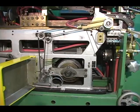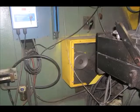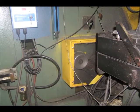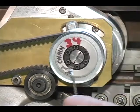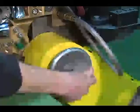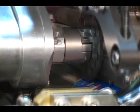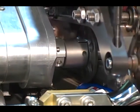With direct drive, machine timing failures due to backlash are virtually eliminated. Timing used to be set back in the feed area using a hammer to loosen up a taper-locked handwheel. With the squaring wheel's rotary gearbox, timing is set more accurately using a timing pulley and locking collar, and by one operator who is now positioned at the squaring wheel assembly in full view of the timing being set.